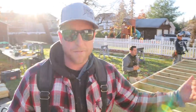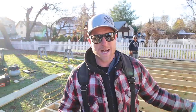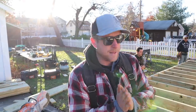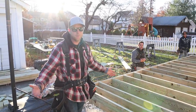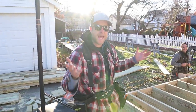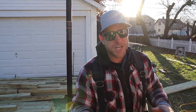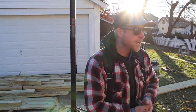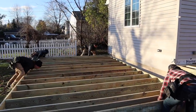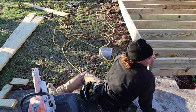As you can see from that time lapse, we've built this whole deck away from the wall here because this is a freestanding deck. That means we have a beam that's right next to the house and we're going to cantilever towards it. We have a block foundation here, so it's not really a good spot to anchor your ledger board. This is a lot easier, especially for a low deck. We're going to push it into place — we have some big strong boys here for that. We'll secure it with hurricane ties just like on a typical deck, but it's totally independent from the house. Zero chance of water infiltration — you don't have to worry about being super precise about your flashing because you're not even touching the house.